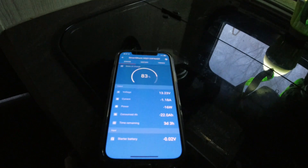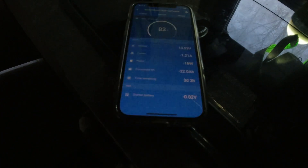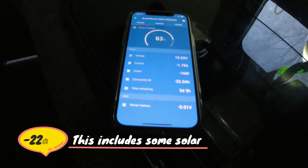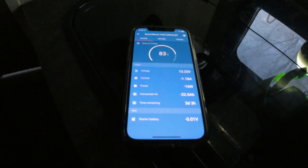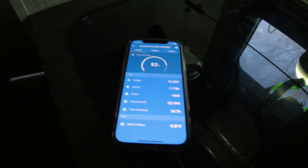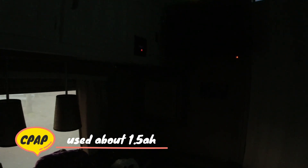After the entire night we're at 83%, and the app shows time remaining of three days and three hours worth of power. We've turned some things off now, which extended it — it was down to about two days at one point. We're only using about 16 watts right now. What we used last night was the WeeBoost all night long, my CPAP without humidity, charged one phone, the fan on low, and the bathroom refrigerator uses a little bit of juice too.